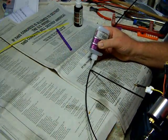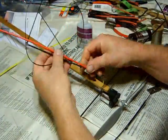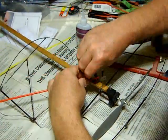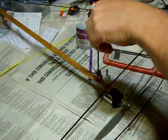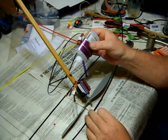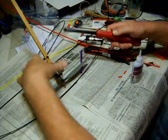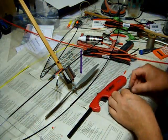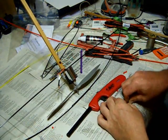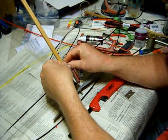This is the front leading edge of the wing. This is the rudder that I made — I didn't film when I made it, but it's actually kind of cool. It's the thin flat stock just sort of bent around, with some threads on there to reinforce it and keep it square. I put it through a piece of nylon tube through the wood fuselage, then a little piece of heat shrink on the back with a little bit of CA, and then a small piece of tube over top of it.